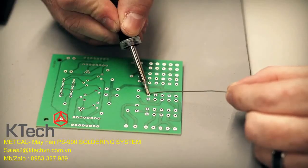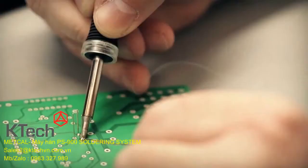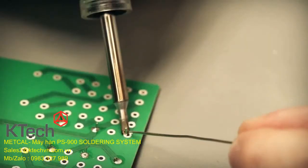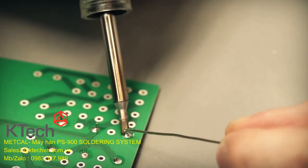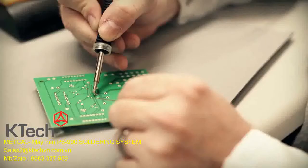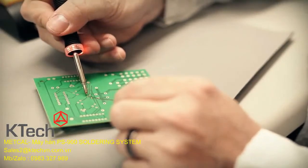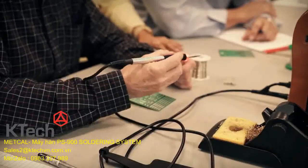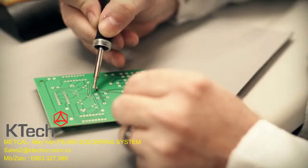The solder event starts with a red-green flash to the operator, signaling that the solder event has started. The user applies solder per their process, forming a thermal bridge. When the green light illuminates, the solder joint is complete. A red light on the handpiece signals to the user that the solder conditions have changed or that the IMC has not formed correctly — an example is prematurely removing the solder tip from the joint.